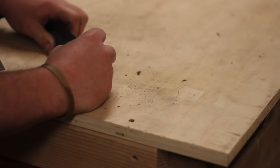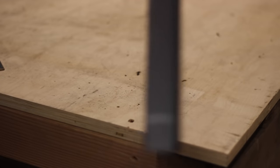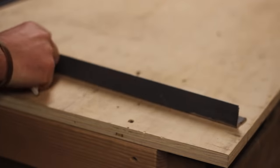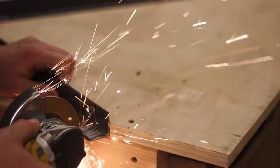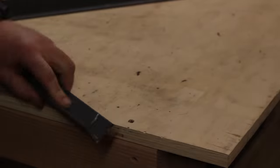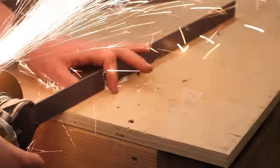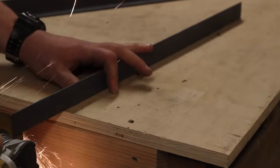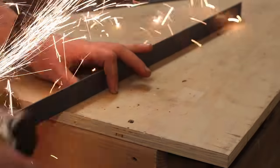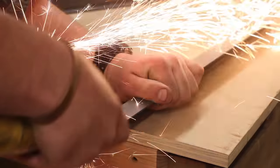For the lettering itself I like to use lap joints when I'm working with angle iron. I mark them off and then go ahead and cut them out. I take the grinder and cut out the section marked with the soapstone. This is a pretty simple way to get a nice tight joint that's easily weldable and you're not working with miters or having to cut angles that look sloppy. All of this is going to be hidden in the back of the sign anyway.